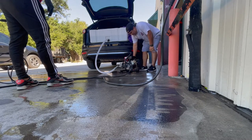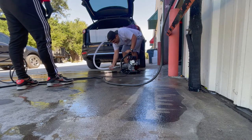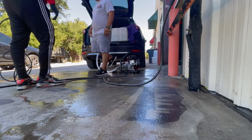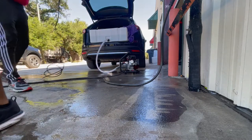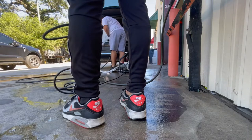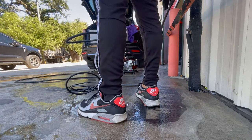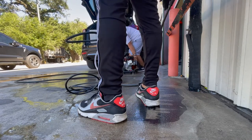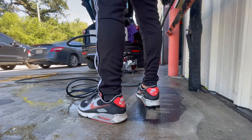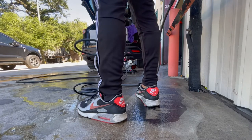I'm back in frame and we're going to turn down the throttle so we don't overheat that pump, and adjust the hose to make sure there's no air leaking that will cause cavitation. I'm grabbing the garden hose and getting Ed on the spigot to turn it on so we can push some water in through the outlet of the tank. I'm putting my arm in — you can see me a little bit until Ed gets in the way — and here in a few seconds you'll see that hose shake just a little bit. As soon as the prime hits, I'm turning up the throttle again. And there you go — you can see it vibrate and a little bit of pressure starting. Pump is primed.